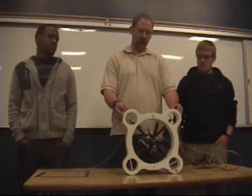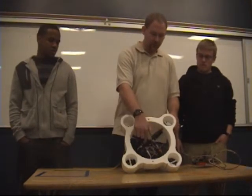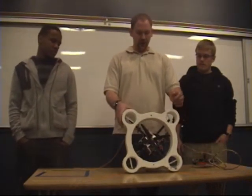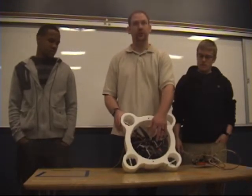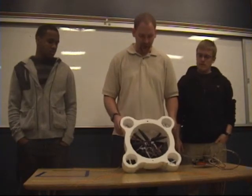Our project was a quadrotor. It started out in concept and it kind of morphed into a monorotor. For simplicity reasons, we went with a counter-rotating propeller mechanism. This produces zero net torque so that it maintains stability in the plane. The other key feature is to have the center of gravity stationed directly below the center of rotation so that it's self-stabilizing once it's in flight. We don't have any accelerometers or gyros on board, which is one of the things that made it a lot easier to make.